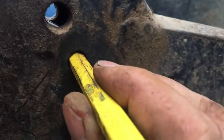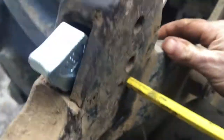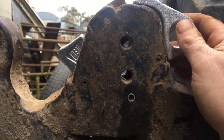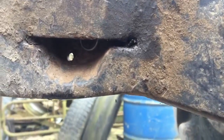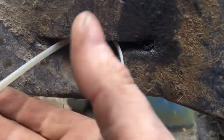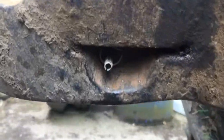The most important piece — see the galvanized steel that's still there? That's the word I'm looking for. Let's hammer it home because you don't want the triangle piece to have fallen down. Great, that's now the roll pin in, all working, still perfect. Now get the spring in — the spring has to be under tension and pull down into this hole here, then the roll pin has to go in. The technique I've been using: get a zip tie through the spring so you can hold the spring down while hitting the roll pin from the far side. Brilliant — that's that one done.